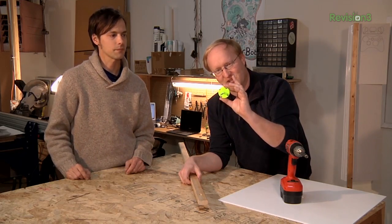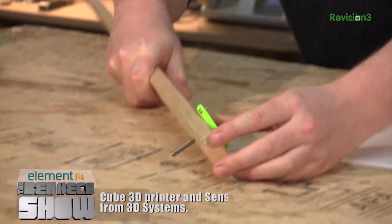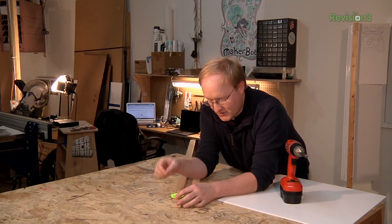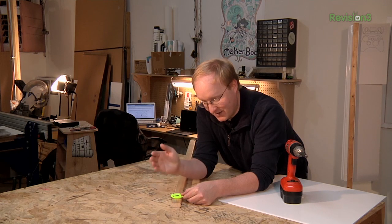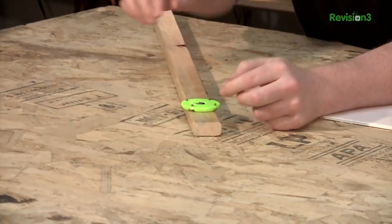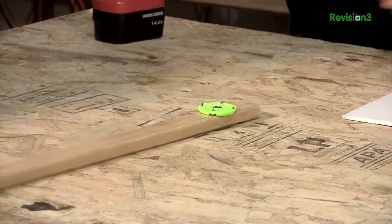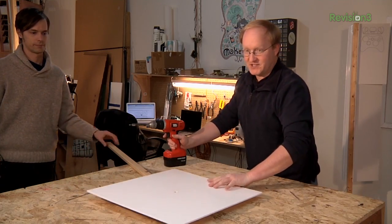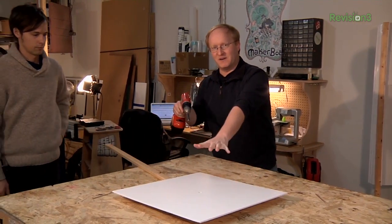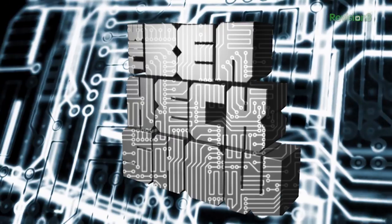We printed this part on the Cube 3D printer and it fits through this hole on our 2x1 and spins freely. We're going to put it into the table — Rusty, could you wing-nut that in place? When he attaches the wing nut it will clamp to the table, but the stick should still rotate around it. Basically, that means this stays in place while the arm moves. We'll put the Sense Scanner on that, which gives us a nice circular motion while keeping our object centered. It would be nicer if we could do this off the ceiling, but this was a lot easier to build.